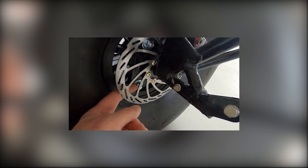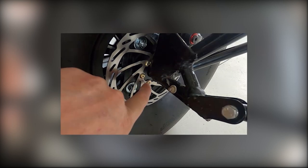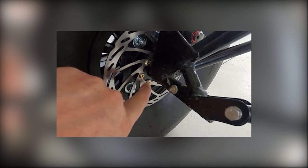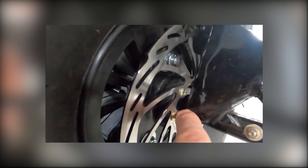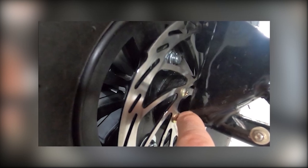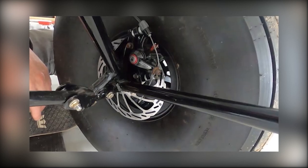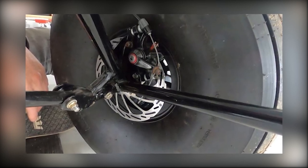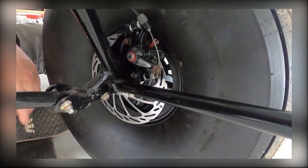I'll give you a bit of a look right now. So there's the spacer in there — maybe a bit hard to tell, but it's there, it's black. Locking nuts, the discs, these are the screws that went through. Right there is where the axle goes through, and there's a spacer between the axle and the bearing of the Azusa light wheels itself. It's the brake — just a very, very basic BMX-type brake caliper setup, more than sufficient for what I'm using on the aircraft.